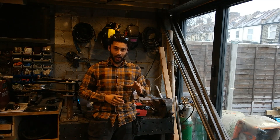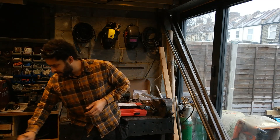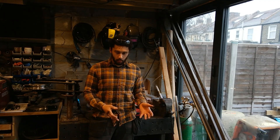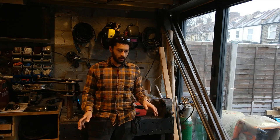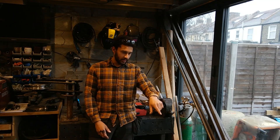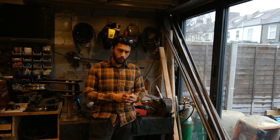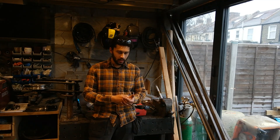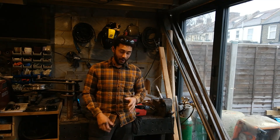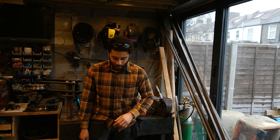I've been messing around with this thing all day yesterday — I'm really running out of time to get it into the Land Rover. I go back to work on Monday and it's now Thursday, and I wasted all day yesterday trying to get this thing started. I just couldn't figure out what was wrong — I could remove all the fault codes, but I wasn't getting any pressure at the fuel rail. I checked all my connections, took off the injector hose, I was getting fuel up there — I think it was the connection at the regulator valve at the back of the CP1 high pressure pump. I took it off, put it back on, took off a few other connections, put them back on, turned on the ignition — and it fired up. Honest to god it really frightened me because I wasn't expecting it to start. I've been cranking it all day and it fired up — so you can see what I mean; sounds like a bit of a pig at the moment because there's no pipework on it, but it runs.